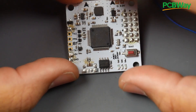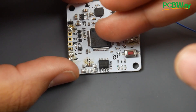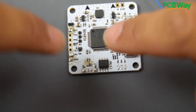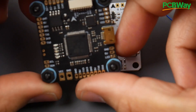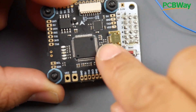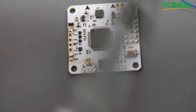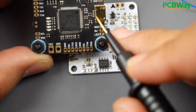I chose a very simple board to demonstrate. For the USB protocol to communicate with the microcontroller, it needs a 22-ohm resistor on both D+ and D-. These two are right there, usually very close to the USB area. Here's another example on the Mamba — if you measure the small black resistors near the USB, they'll read 22 ohms. Those two resistors where my finger is are the 22-ohm resistors for D+ and D-.